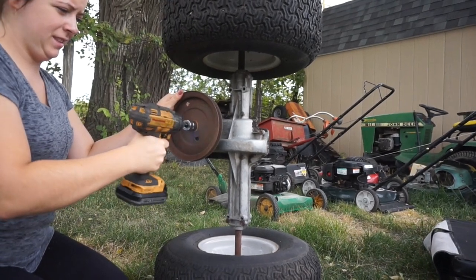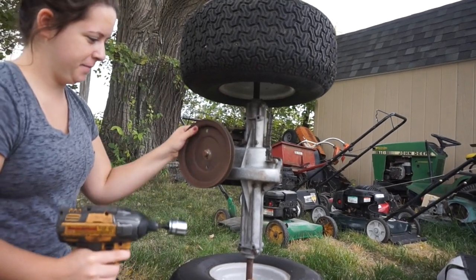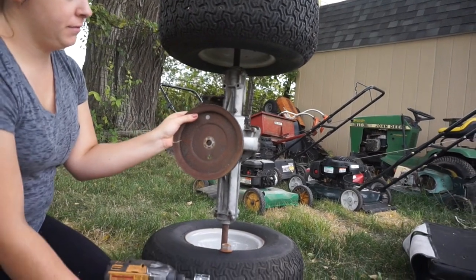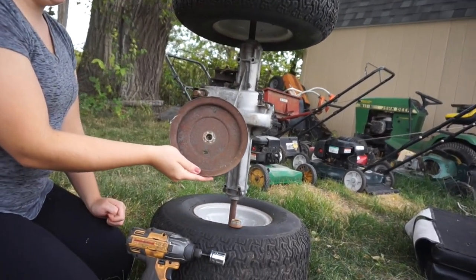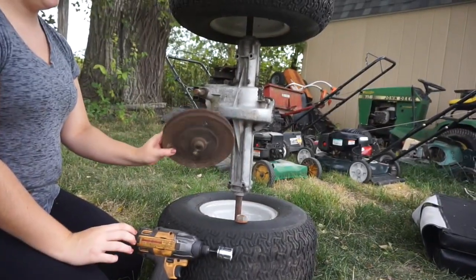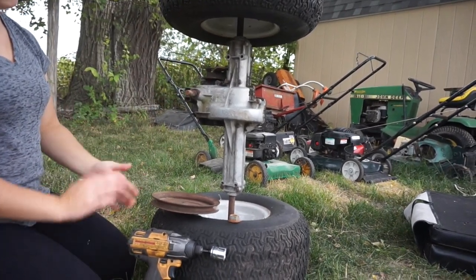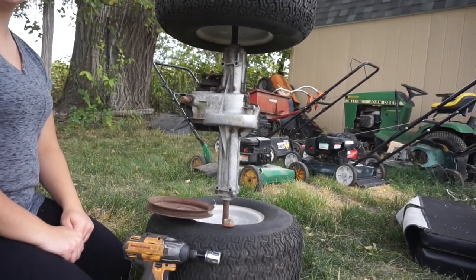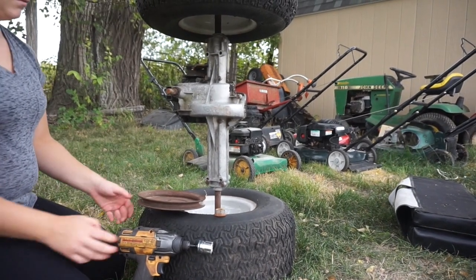Keep going. Yeah. So we're gonna downsize this pulley quite a bit, and you can see it's a splined pulley. I think our best bet is going to be to find one with the same diameter and weld it in place, because I'm not going to have one of those splined pulleys. But if you're doing this at home without a welder, in the next video we can talk about another method for getting to your desired gear ratio. So let's lay out the rest of the cart and we'll be right back with that.